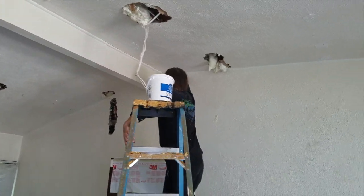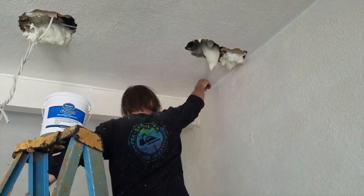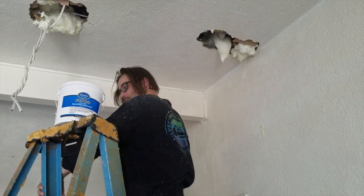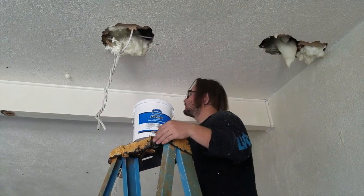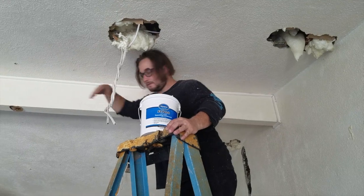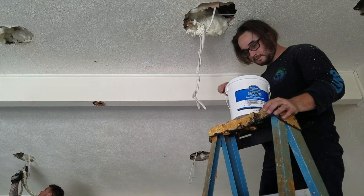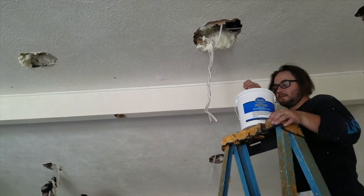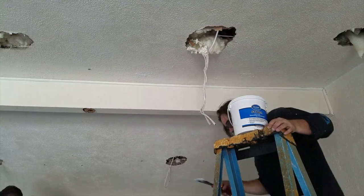If we have a flat ceiling, the material has nowhere to go. It doesn't roll anywhere, and then it would activate right there and you'd have a big blob of material right at the area you injected it — it would not fill up the cells. You would probably end up blowing out the drywall if you tried to do it. There's a lot of pressure in this material and it has to go somewhere. It has to be on a vaulted ceiling or a vertical wall.